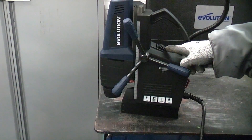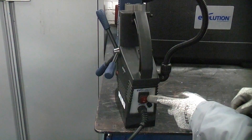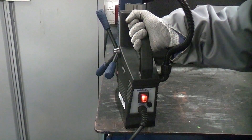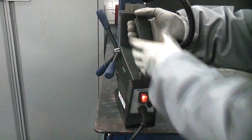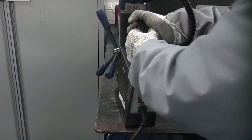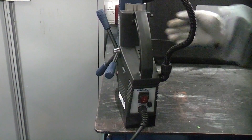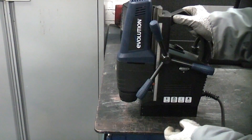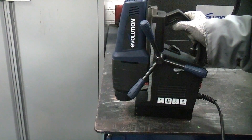On the top of the machine there is the on/off button for the drill. At the back there is the switch for the magnet. Once that is switched on, the magnet is incredibly powerful — it is virtually impossible to pull the machine off. Normally you would leave the magnet switched off until the drill is in the exact correct position, then switch on the magnet at the back to hold it in position whilst you do the drilling.